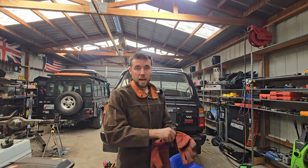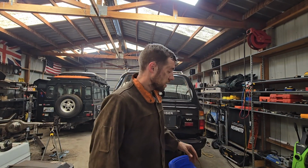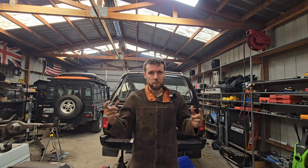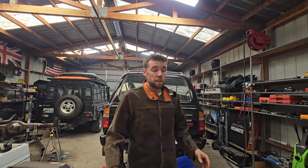Now guys, one thing that I've noticed, not in the instruction manual really, is on top of the actual plasma cutter itself. It has some sort of settings for if you go with this many amps and you're cutting for this many minutes, you've got to let the plasma cutter rest for this many minutes. It plays into that thermal overload thing. So you don't want your plasma cutter to get too hot. You want to let it rest for a little bit. I think it's 6 minutes of cutting at 55 amps is 4 minutes of rest, something like that. So this actually works out well.